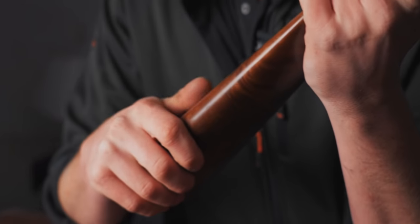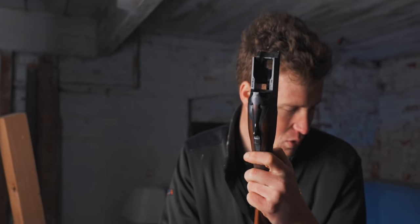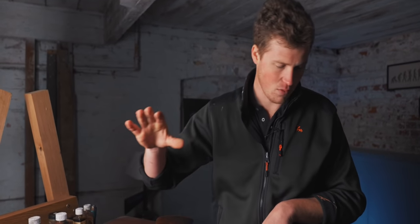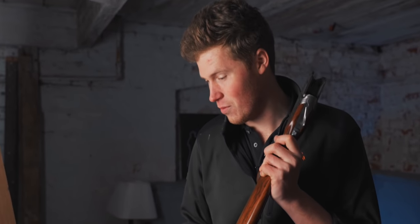For a high-gloss oil finish, the approach is exactly the same — wax it. A lot of people feel the need to feed wood, but if you have a nicely finished piece you won't need to. Essentially, strip them all back, spend the hours and love turning it into a good quality finish — which we'll do a separate video on — and you'll be satisfied forever because putting in the effort up front saves you patch repairing later. Most importantly: never use too much oil. Too much is worse than too little — if you put too much on, you'll have to cut it all off and start again, and blending in a small patch is not fun.